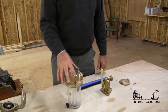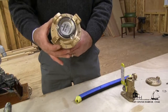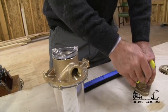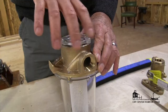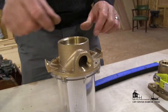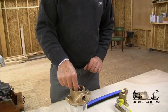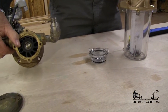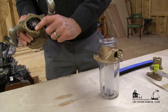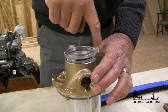Next in line, you may find an inboard sea strainer in your boat. This is a perfect example — this is a Groco, and it has a removable cover. You would shut your sea cock off, open up the Groco sea strainer, and inside is a little basket that will catch all the debris that would either clog the system somewhere down the line or cause debris to enter our salt water pump and possibly clog that. We want to use this device to protect our water pump impeller, because if debris gets into the impeller, it could break the vanes off and cause more destruction. It threads right in very nicely.